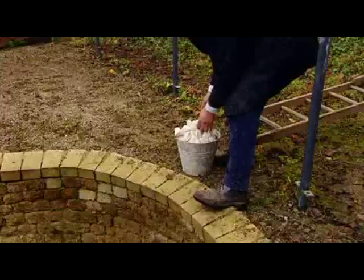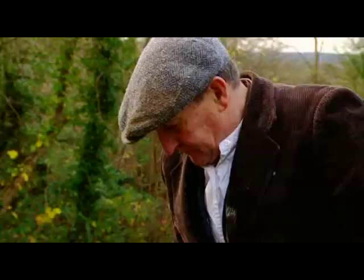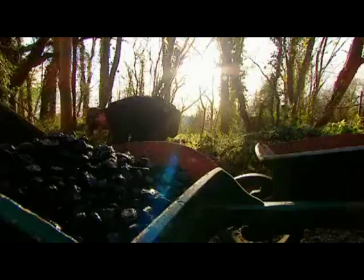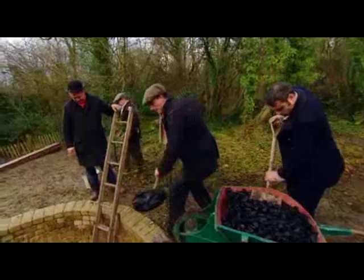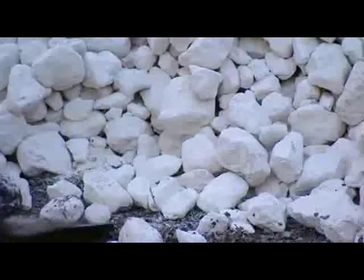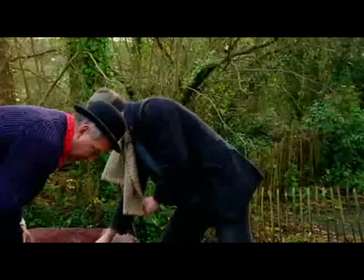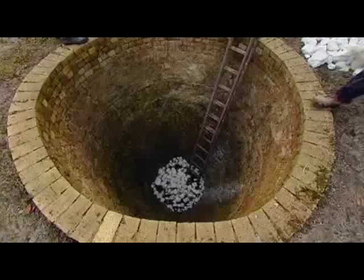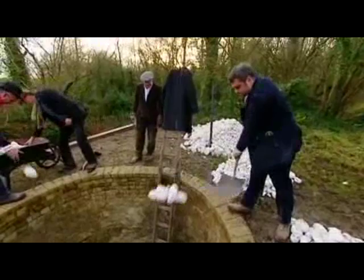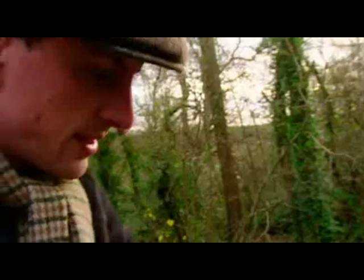It's Peter's job to ensure the critical first layer of limestone is spread evenly. Next, a layer of coal, then another layer of limestone — this will be 25 shovelfuls. Stafford's concerned that unless the amounts in each layer are precise, a constant 900 degrees won't be maintained and no quicklime will be produced. So we're looking at quite a few layers here — a total of 15 layers of fuel and 15 layers of stone.